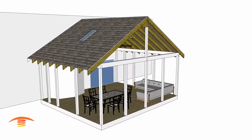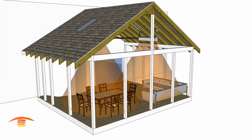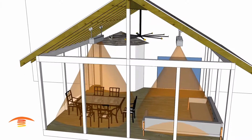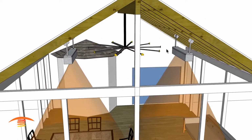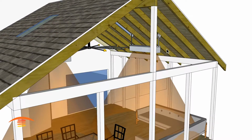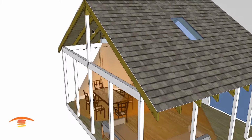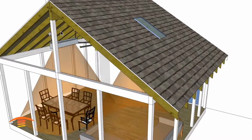All right, let's go ahead and look at a gas heater. Now, if we were to use gas heaters, the most important thing is this is a screened-in room, and the customer sent me some images, and I'm not quite sure if these triangular open areas here are screened or are they some type of glass. If they're glass, then we have to make sure we have a place for the exhaust gases to evacuate. If it's screened in, then the evacuated gases will just leave this area here without an issue. So that's one thing I just want to mention.